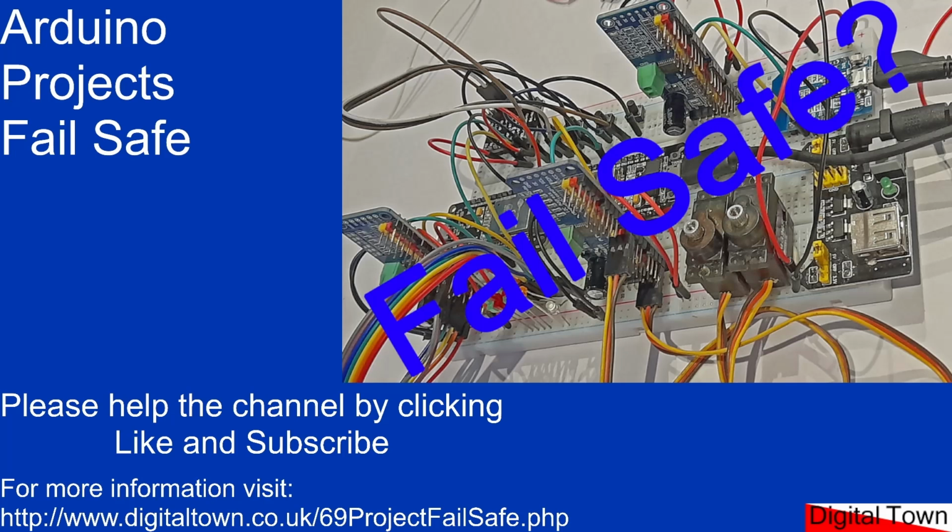Anyway, I hope that's helped in giving you something to think about, thinking about how things fail safe, and especially think about switches and things to do with wires breaking. If something breaks, is this going to stop sensibly? Simple example, when you get a problem with your car, it doesn't just jam the brakes on. It usually comes up with a fault light and your car goes into limp mode. In other words, it's allowing you to safely maneuver to the side of the road and stop. And it's having that same mental attitude when you're building your projects.